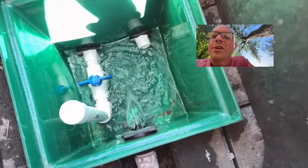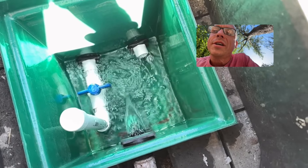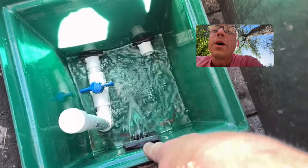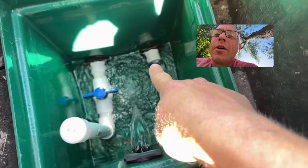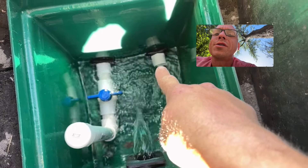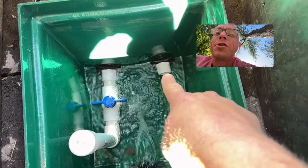I just got done cleaning all the silt out of the bottom of the silt trap, and I'll show you guys that chore in a future video. Right now, all the mountain spring water that's flowing into the spring box is leaving via this water line right here. This water line is piped underground and bypasses the 2,000-gallon concrete water cistern and all of the other portions of the water system that I'm about to show you.